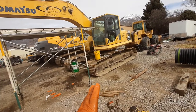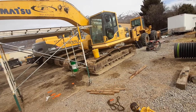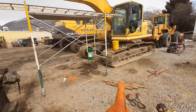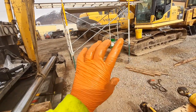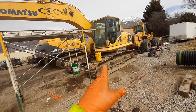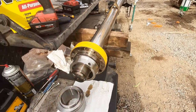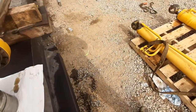These rams are the same all the way up from a 200, maybe even a 150 or 160. This is a 200 dash 8 — any dash 8 excavator. I also know that the Volvo has a left-handed threaded keeper nut for the main nut, and you can tear those apart on your bench too. For Komatsu, I think this is the same for the 360, 490s, all the way up to even the 800s.